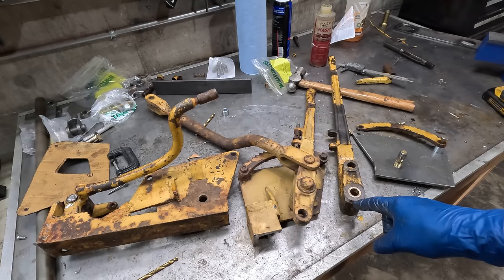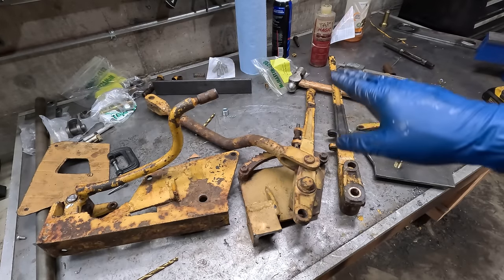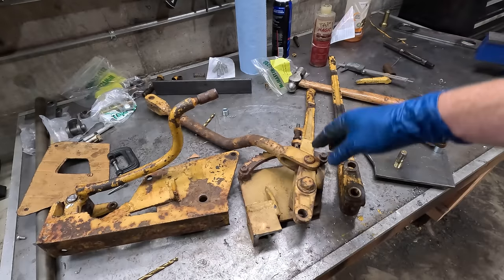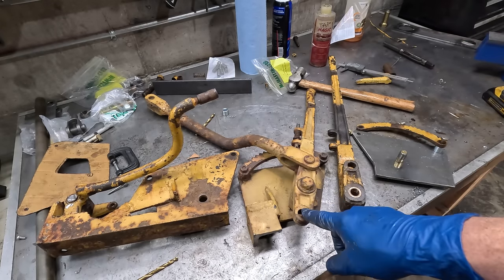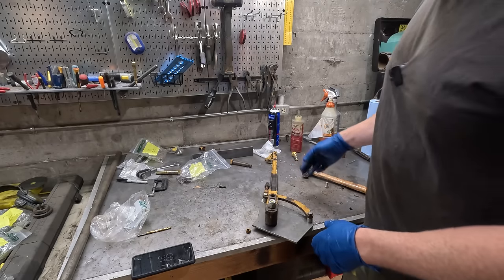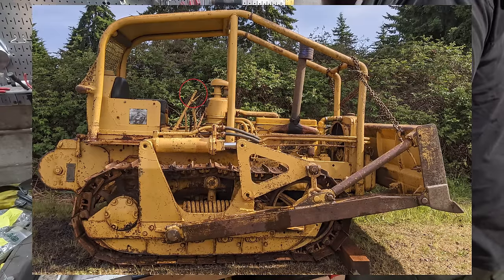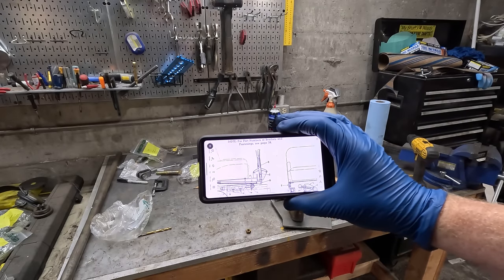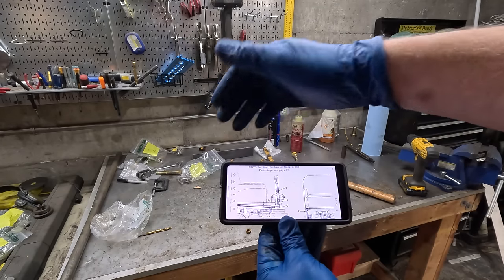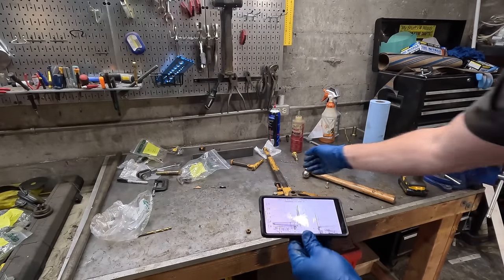This one, it's cut off, and I looked it up in the manual. This position is for a normal overwinding position where the rope goes over the top of the winch, and this is for if you underwind it, you need to change the way that the brake's set up, so that's what you use this for. Got a little bit turned around because I was looking at old pictures of my tractor when I got it home, and they had this handle installed backwards. Then I looked in the manual here, and this is the seat, so the little pull handle is supposed to be in back.